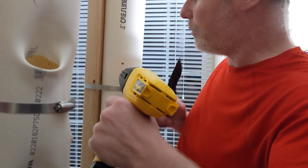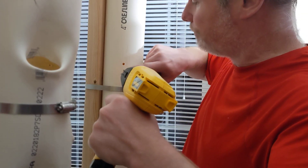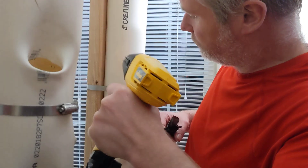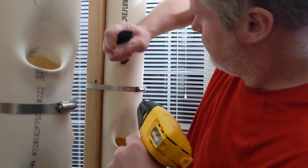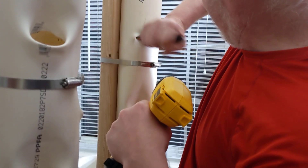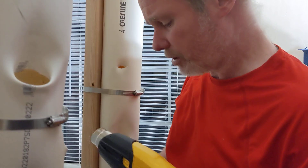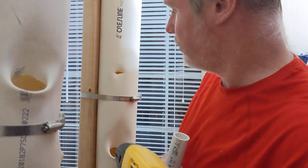The standpipe, because it's such a thin wall, it doesn't take very long to heat up at all. It's actually starting to get soft already. And then once it starts to get soft, I cut a horizontal slit — about, I don't know, three quarters of an inch. And then I continue heating.